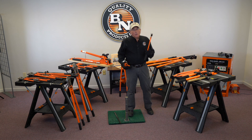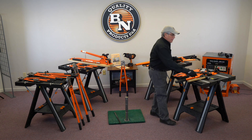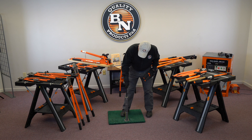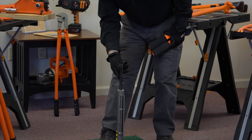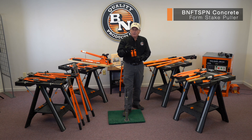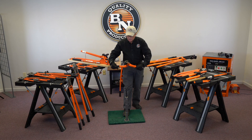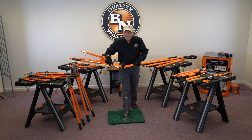If it's a big job, one guy can be pulling nails while the next guy follows along with the stake puller. But contractors asked us: can't you just combine them together? So we did. We created the unit with both the nail puller and stake puller built into one tool. Once again, imagining a board going across the front, you use the nail puller on the stake puller — it slides down, grabs the duplex nail, you pull up, the nail comes out, then you just flip the tool over, put the gripper rollers on, give it a couple of twists, and out comes your stake.